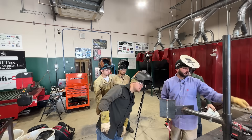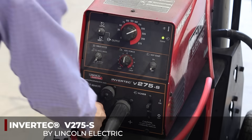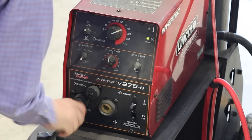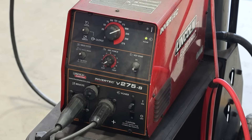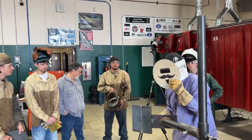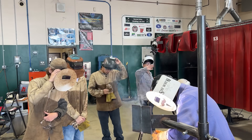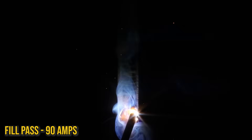Let's switch to stick. The biggest thing when switching is to flip the polarity — pull the TIG lead out, move the ground to the negative spot, and the stinger to positive. Switch to stick arc force. If you're running a 7018 on negative, it's pretty alright — if I want to run hot with 7018 I'll go negative 10, about 90 amps for a 3/32 rod. Let's stick weld — put a single bead pass, do a little weaving. Strike the arc, get a puddle going. I pause on my sides, just not that long — I stay in my puddle a long time, staying tight.